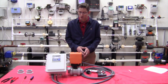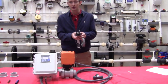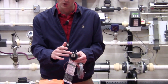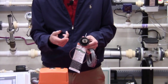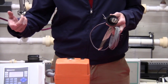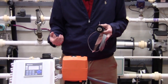Now let's talk about each individual component — how it works, where it's mounted, and what it does for you. Our paddle wheel flow meter will be at your fill station. The paddle wheel mounts in your line; as the bleach or sodium hypochlorite flows past it, it spins the paddle, which generates pulse outputs. It's hardwired to the display inside the enclosure, and the display counts those pulses and, based on a predefined k-factor, converts them into gallons or total flow.